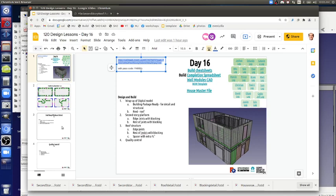Maybe what we'll do, we did a 9-footer, starting to get your head around that one. The 8-footer is pretty much the same kind of pattern, except, let's see, how long were we hanging the plywood down enough so we don't slip off the top plate. On the second story modules, which are 8 feet, they don't have top blocking, right? So we can't slip the plywood down so it falls off the top plate on an 8-foot module.